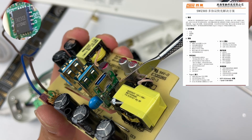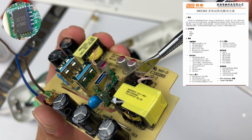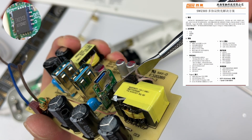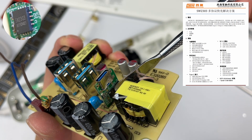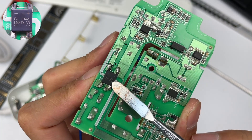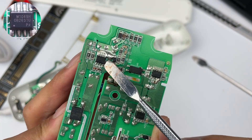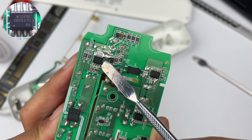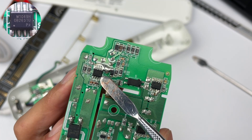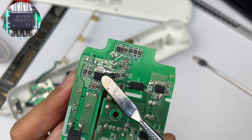This is the first non-MCU and QC5 certified protocol chip, model iSmartWare SW2303. It has high integration and can support both USB-C and USB-A. This is the output VBUS MOSFET, and this is the RABS210 bridge rectifier. The master control chip comes from OnBright OB2631U, which integrates a PWM controller and MOSFET, optimized for high-performance, low-power consumption switching power supply.